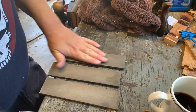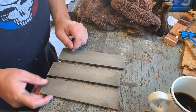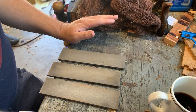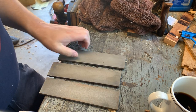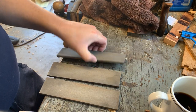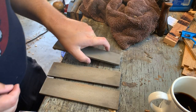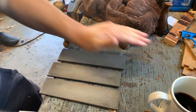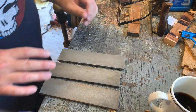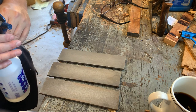So, to sharpening. I have diamond stones here — you can use sandpaper, but I really like the diamond stones. These are cheap diamond stones; if I had this to do over again I would buy ones that are a little bit wider. Everybody likes to build a little caddy for these, but my problem with that is it makes it hard to get to the edge of the center one. I just leave them alone. I like to hang them over the edge of the bench at a slight incline, and I feel like I can work with that and keep my hands perpendicular.